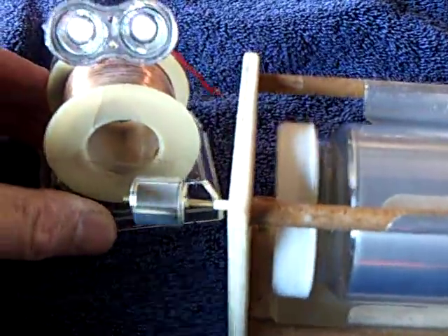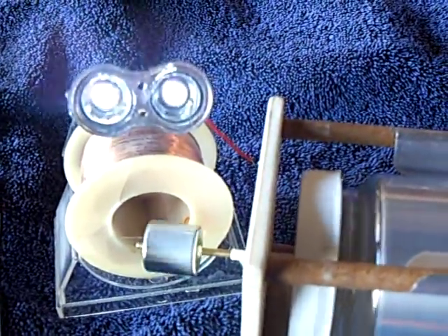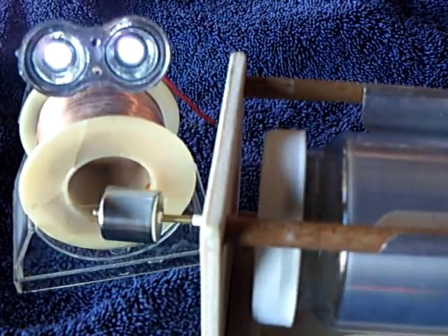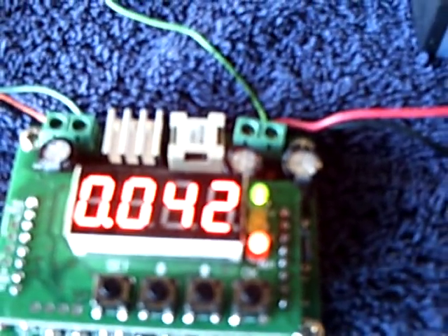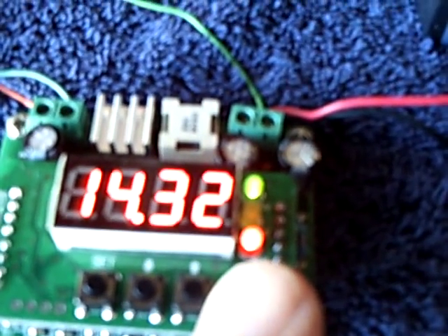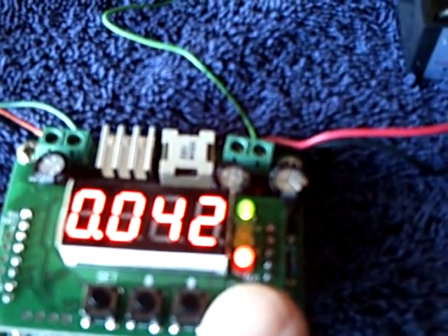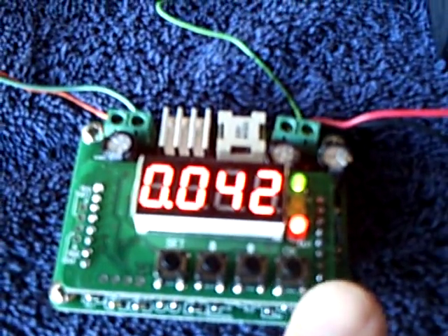Now I'm going to load the motor down again — almost stop it. And that's with the coil loading down that magnet. You hear the motor slowing down, but it will continue to run even at that low RPM with that load — just greatly reduced in RPM. But check this out: my amp draw has not altered. There's my voltage, 14.3. I have this preset at 50 milliamps, so if it ever goes over 50 milliamps, it just shuts off. Very, very handy little device — I wish I'd had this for years and years.